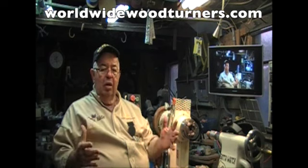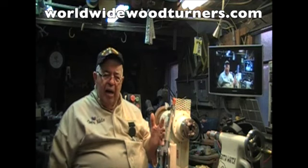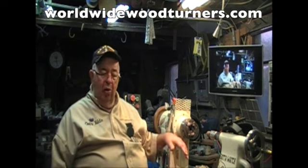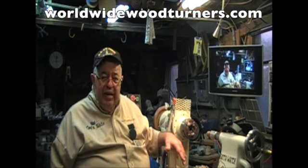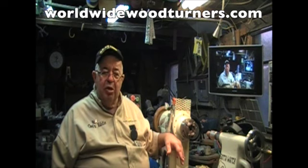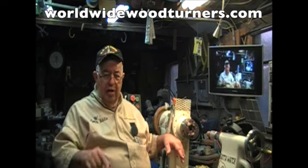Now, I'm a great fan of YouTube. That's where we are now. Okay? But there's not a lot of truth and a lot of work on YouTube. And sometimes you see something from a guy who's doing a show to make you stick around and buy the XYZ tool or whatever. I'm not into that. I really don't believe you need carbide. I sell more than anybody else in the world, I believe. But I don't believe you need it. I think you can get along without it. I think you need to know how to sharpen your tools. And you need to learn how to use tool cuts. If you'll do that, you'll turn out some great-looking work.